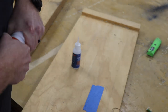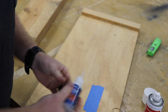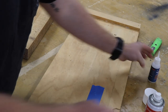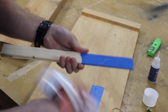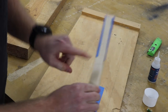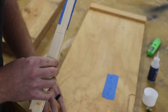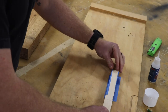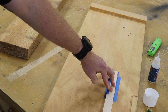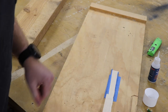Super simple. You've got accelerator and the glue — this glue dries super fast. You're just going to put a couple drops of CA glue on the board, then take some of the accelerator and spray it there. Not too much. I have my pencil line on the top of the shim and the pencil line on the actual sled itself, and I'm just going to stick it on there. Hold it for about 10 seconds and it's good to go.